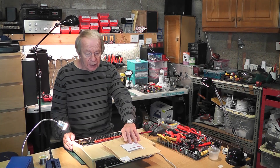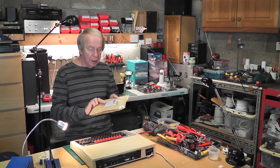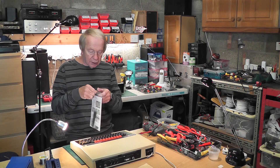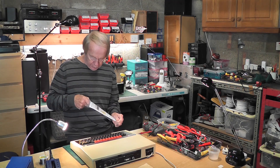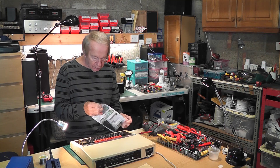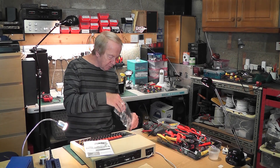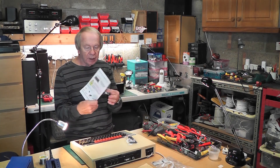This is a shorter video and it shows how to repair that power supply properly. This time I've gone online and ordered from coolnovelties.co.uk a repair kit. The kit comes as a pack with everything you need, including an instruction booklet. I've chosen to replace three capacitors: one electrolytic and two mica capacitors. When you open the bag, it comes complete with the capacitors you need and even cable ties.